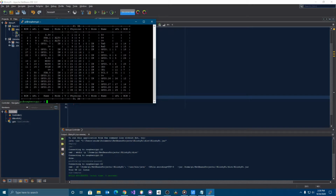Those are the port designations for WPi, which are generic and defined specifically for the wiringPi code. It's not related to the BCM numbers. As you can tell, they're different. And the reason they do that is for portability across the board.